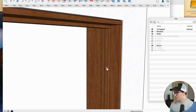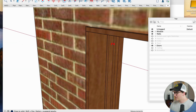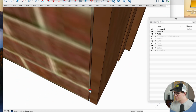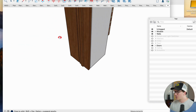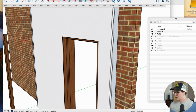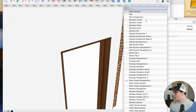This will come with the door itself, but then we'll add on this extra piece of wood here. And you'll notice that there's a little gap around the frame that we're going to put in with some 16th inch rubber that goes behind the entire door frame and actually goes across both walls. And that'll cover up our gap between the door frame and the double wall system, and it'll make sure that sound won't easily pass between the two walls. So that's an important part of this.